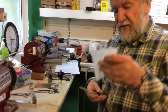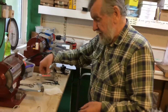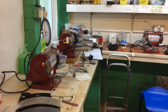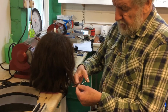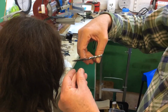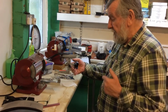And likewise with this scissor, it should just slide through the material or the hair. In fact, I have over here a hair doll, which is something that all trainee hairdressers use. So I can take one of these scissors here, take this one, and I can do a cut test and watch, straight through. There's the hair. It does not push the hair along, it simply slides through. If after doing that it didn't feel particularly sharp, then I could grind it.